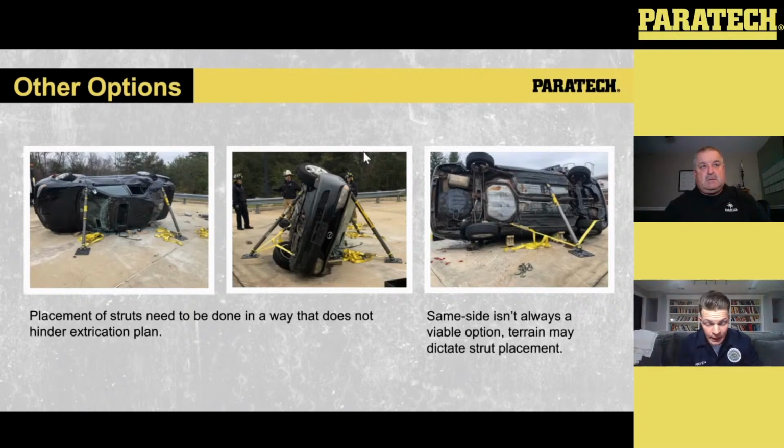that are stabilizing the vehicle. Now, in these pictures, you can see the gray series strut tied in with the ratchet strap and the tow clusters that are being connected towards the bottom A pillar and the bottom C pillar on the clean side. On the back side, on the dirty side, we're just looking at the V pattern there and the ratchet strap running through that base handle, the 12-inch base handle, and two clusters that are tying that into the dirty side. So just a different orientation that we may have to apply depending on which way that vehicle has potential to move.